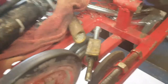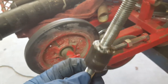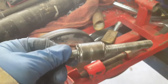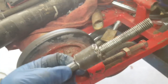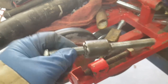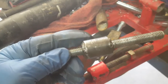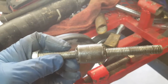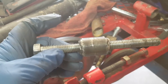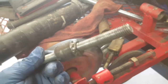So I was going to do that the same way and started another series. I need four of them. But I found something this time — for whatever reason, and you guys that know metallurgy better than I do, this thing would turn nice and free inside the nuts, and the nuts were stationary. But after I tacked things and welded it, it would no longer turn freely. I don't know if I heated and expanded the threads on the bolt, or if something changed in the nuts, or whatever.